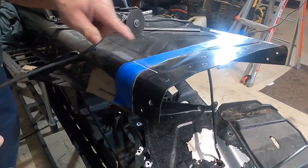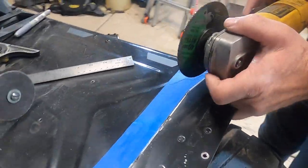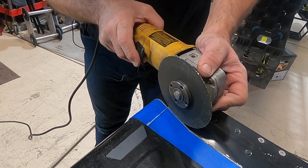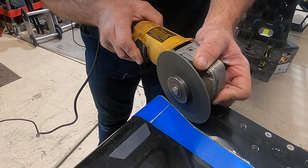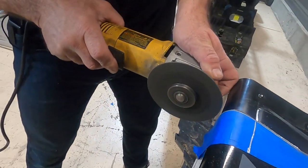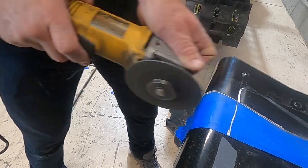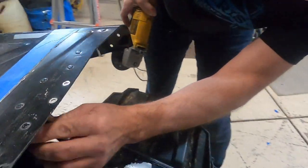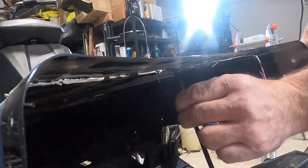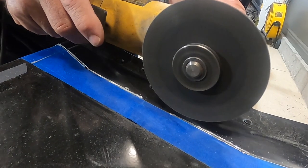That part's loose now. I'm going to come over and do this side. Remember when you turn this on it's going to torque a little bit, so don't have it down against your work area — it's going to get away from you. I can pull the wire down to get it about a quarter inch away from my cutting surface, so if I'm really careful and don't pop this through too far, I can cut this without cutting my wire.